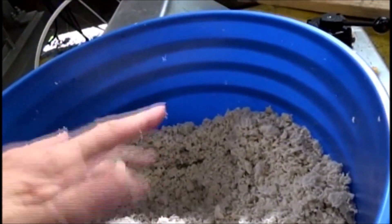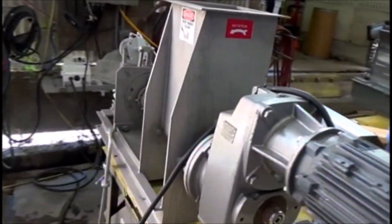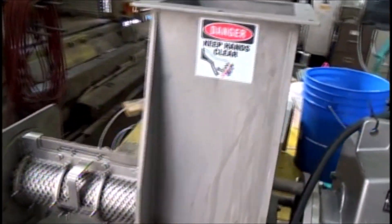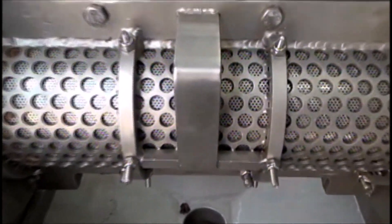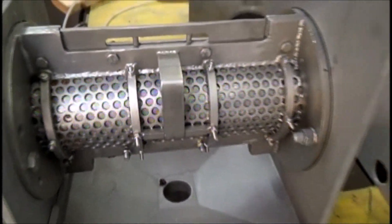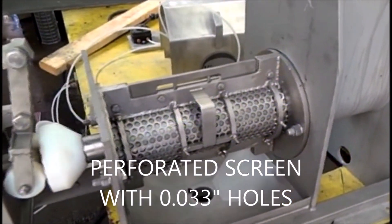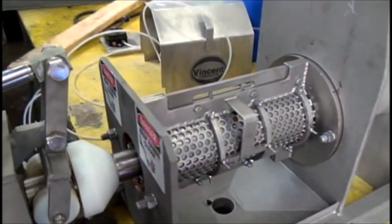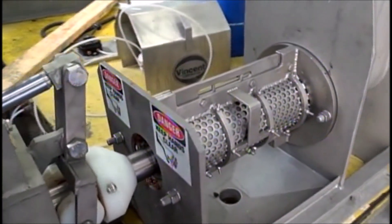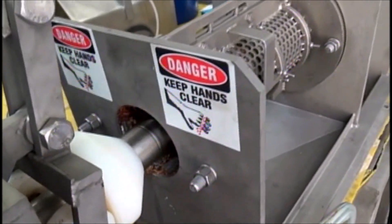It's got some humidity. We're going to run it through this little four-inch press right here — we have a perforated screen on it, and it'll do a good job for us. On pulp and paper material like this Heritage material, we would normally use a wedge wire screen. The percent open area is the same, but wedge wire is a little more robust and abrasion resistant.